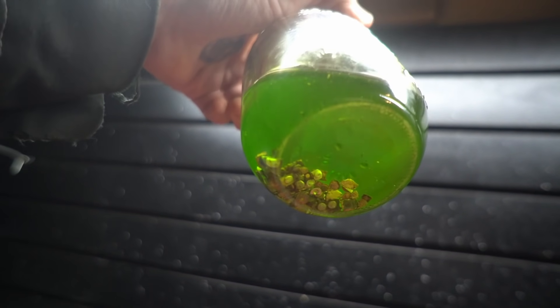So theoretically we now have a small pile of silver buttons and maybe some other bits, but remember how these are not pure? They've got cadmium, tungsten, and whatever else. The tungsten ones will be basically impossible to melt at home. In order to reclaim the pure silver we'd need to dissolve them in aqua regia and precipitate it out, and that's not going to happen without a fume hood. Anybody who tells you they've melted these down into pure silver nuggets is just incorrect. When it comes down to it, collecting silver like this is not profitable — it's time consuming and somewhat dangerous. But as a hobby it is neat to build up a small pile of them, and they are much larger than gold foils. There is a much more effective method to collecting silver from scrap metal and I'd be happy to share this method if you're interested.